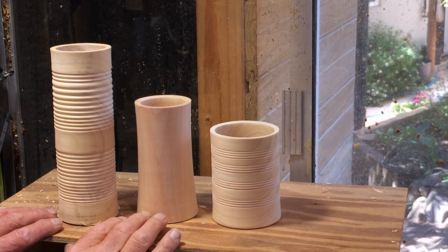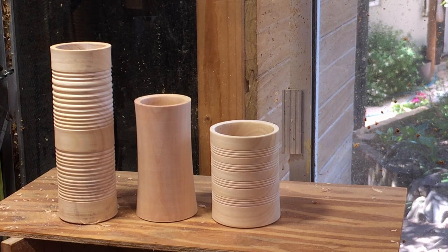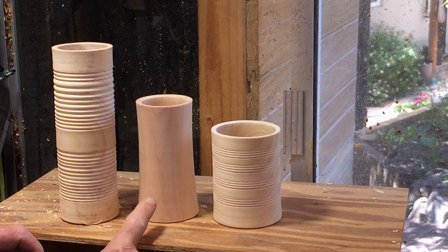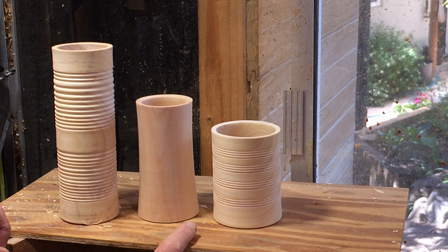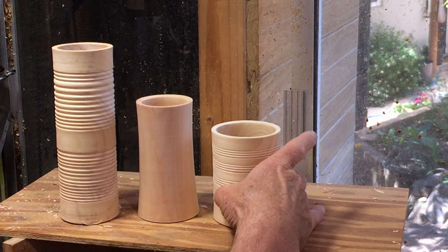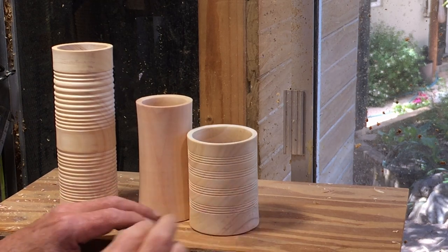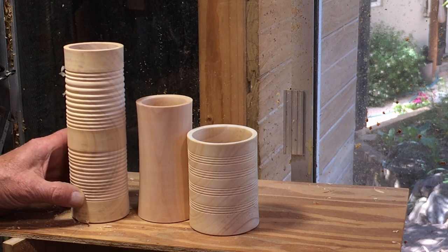This one I made using a skewed chisel, and they were both hollowed using square-end scrapers, which is what you're going to see here. The main difference apart from the hollowing is much harder work going into end grain than the cross grain. But you get more interesting patterns on the outside. Here you can barely see the growth rings, whereas on this one — it's ash, so it's a little bit pale — but there are growth rings running across, which makes it a little bit more interesting.